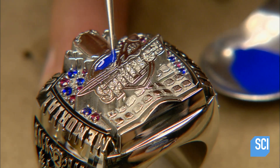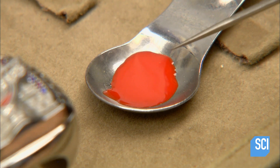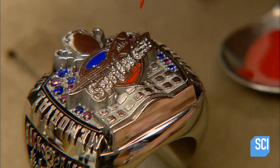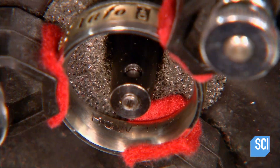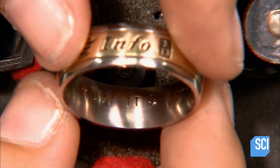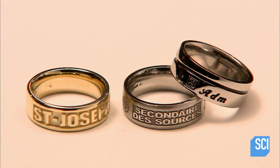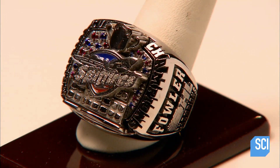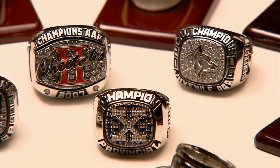A few blasts of pressurized steam and the ring is completely dry. Certain rings also have enamel decoration — enamel is liquid glass; it goes on like paint then has to be baked in an oven for 30 minutes. Finally, a computer-guided engraving machine inscribes any name or personal message customers request, written on or inside their rings. The tradition of the class ring dates back to the 1800s; championship rings — a wearable trophy of sorts — are a more recent custom. Both make a proud and triumphant fashion statement.